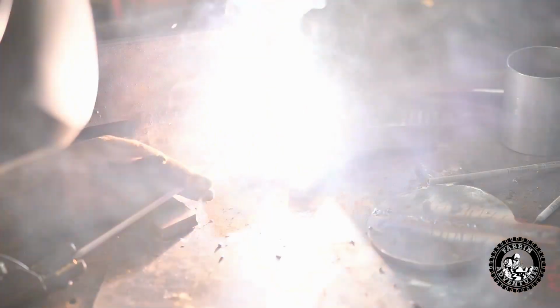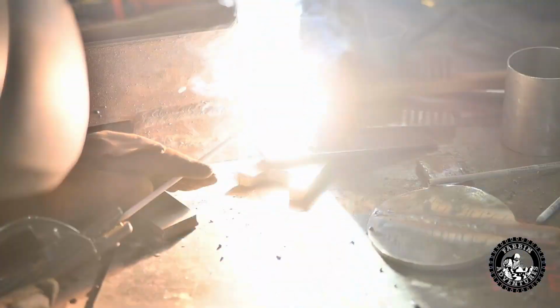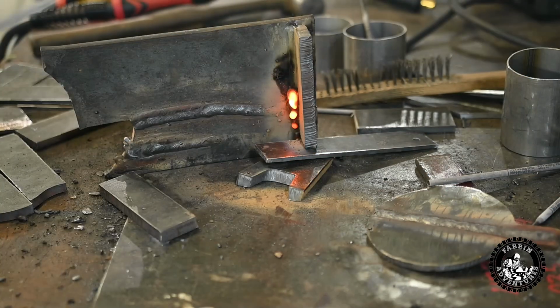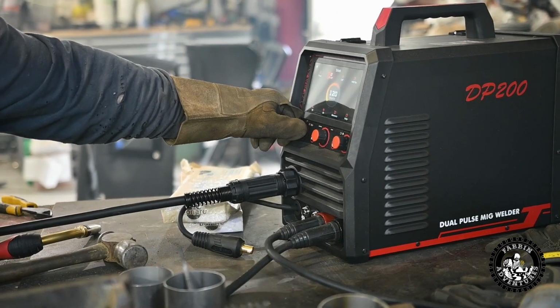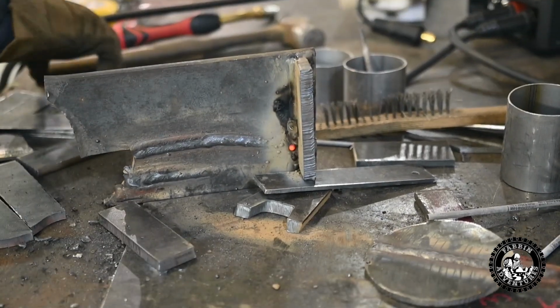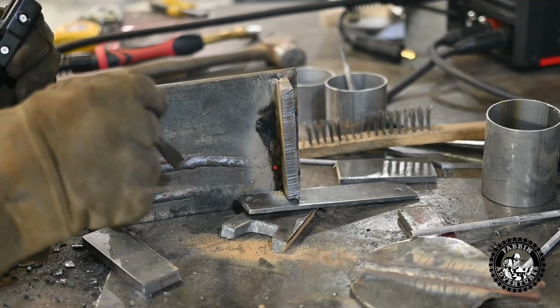I'm actually still a little bit warm. I'm going to have to step it quite a bit here, or I'm going to lose my puddle. Not sure if you can see that or not, but I have to really make some big steps. Yeah, because the puddle's too hot. I'm just going to stop there, turn it down some. It's doing really big, I'm really surprised. So turn it down another 5 amps only, hey? 115 now. Just have a little look at what the current looks like.